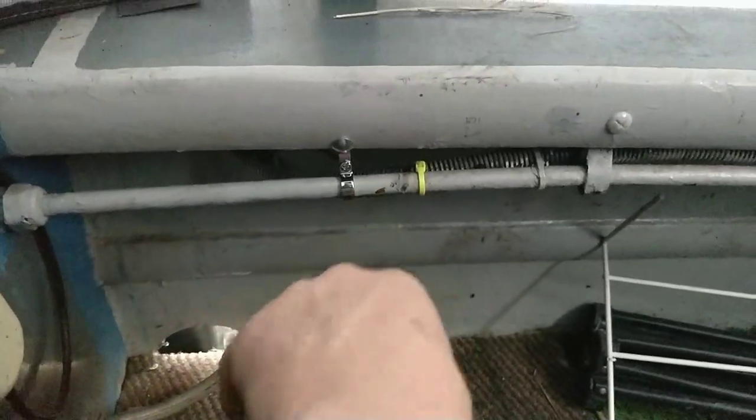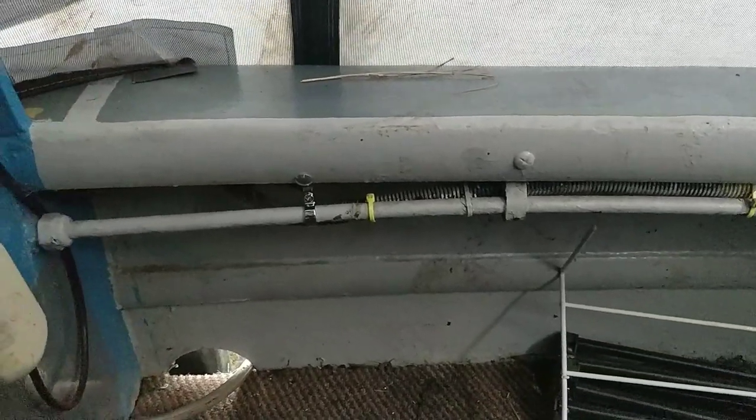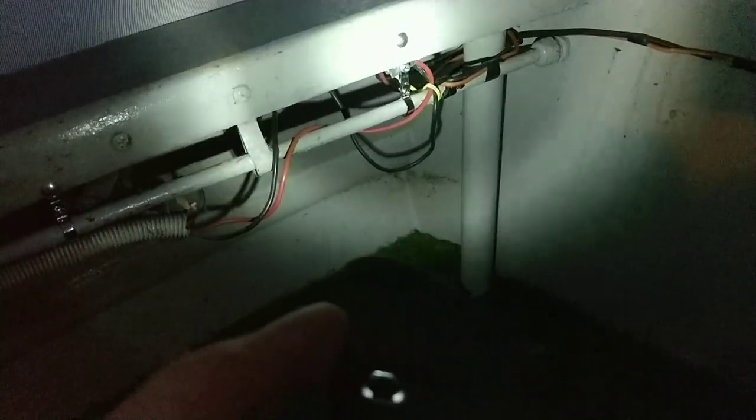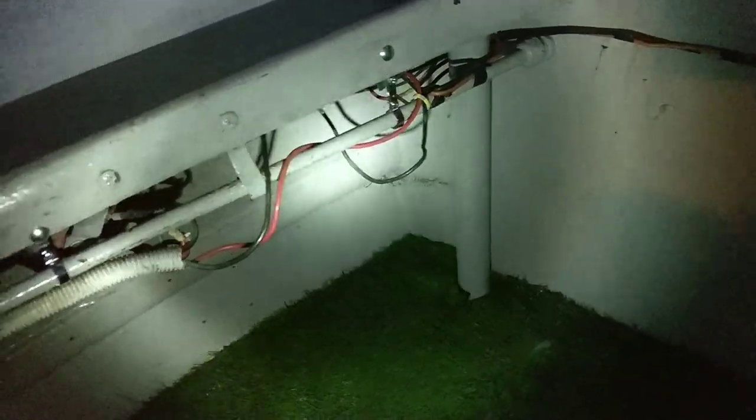It's the first one in place. I'm going to put another 150 mil to there. Look at the LED — because it's LED light. How weird is it? I've got battery torches, not LEDs. One, two, three, four clamps on there now. So that should be sufficient support for that gas pipe under the new regulations. That's that job done.